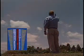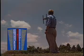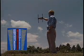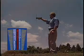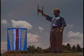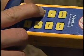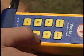Watch the LED display. The lights will move up the scale as the signal strength increases. When they reach a high point, the antenna is facing the direction of the beacon's signal. As you continue to turn, they'll move back down. The higher the reading on the scale, the closer you are to your objective. Adjust the volume to compensate for ambient noise.